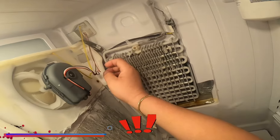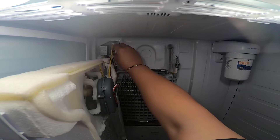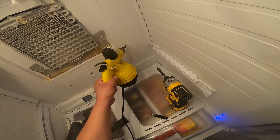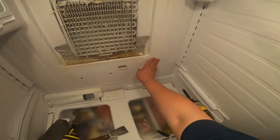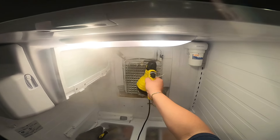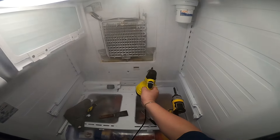After we remove the panel, go ahead and disconnect all the wiring. Take pictures before you remove any wiring to remember how it goes. Then defrost all the ice buildup — as I said, it took me hours the day before. Sometimes you will find frost around the clip area and will have to replace that clip, because the clip from manufacturing is too short. I already replaced the clip about a year before, so that's not an issue this time. But if you have a drain line clog, you will have to replace the clip — I'll link it in the description.